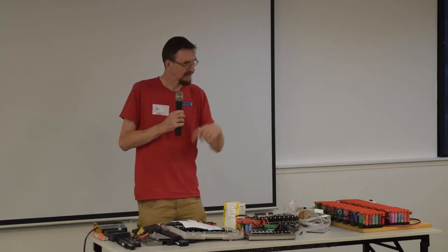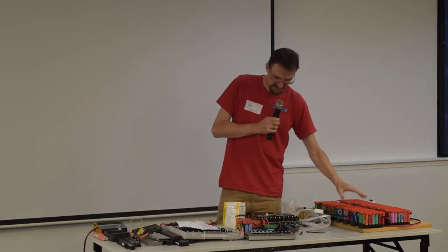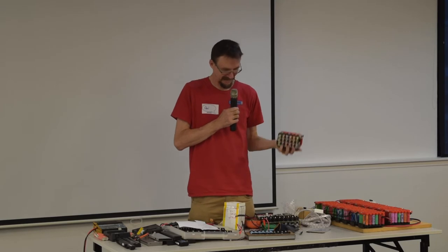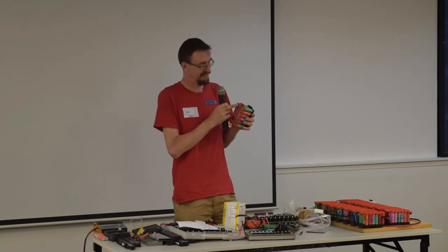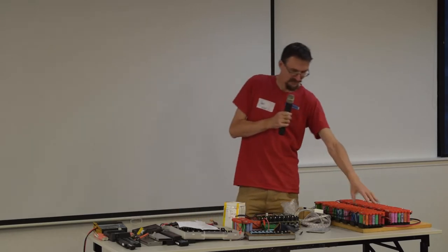If you're interested in finding out more, there's a website called secondlifestorage.com with a discussion forum, people posting pictures, a Facebook group, and a whole bunch of people doing YouTube videos as well. I'm on YouTube — if you search for Paul Kennett you'll find me. The next thing to consider is mitigating safety risks — there is a reasonable amount of energy in these, and if things went wrong they would go quite spectacularly wrong. One of the things we do is copy a trick from Tesla: we have a fuse from every single cell to our bus bars. Pretty much every other EV maker uses much larger cells and doesn't need to go to that level, but you fuse every single cell.